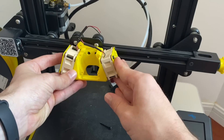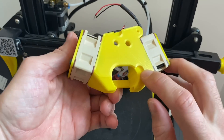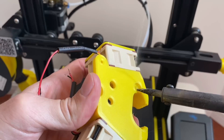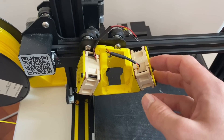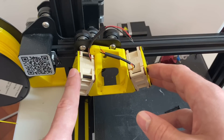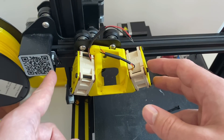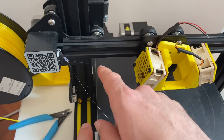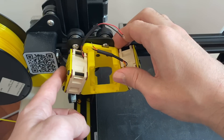We've run into a minor problem — when trying to mount this on the bracket, it will not sit flat because this little bolt head is too tall. Looking on the back side, there's a little pocket relief for it, but this pocket is not deep enough. So we're going to do some manual adjustment with a soldering iron to get that to fit. Now I've got a hole burned into the back and it can be mounted up just fine. The second problem is that moving the extruder over to the left, we're actually contacting this QR code cover instead of the homing switch. If I hadn't caught this, the extruder head would have tried to ram itself into this cover when auto-homing and possibly broke something. We're going to do a bush fix temporarily with hot glue — though I don't recommend this because if the hot glue falls off, we'll have the same issue again. With that hot glue added, we will now hit the switch before crashing into the QR code cover.